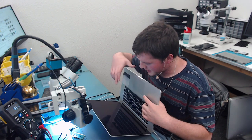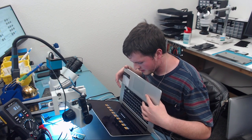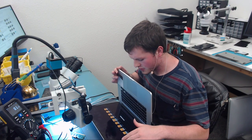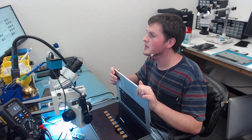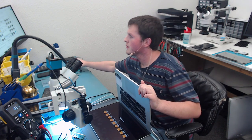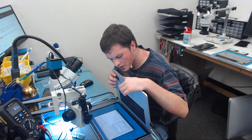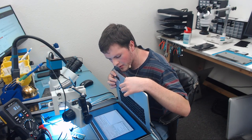Also, sometimes if they don't go in right away. There it goes. So let's go over here to 3S155, which should be the right one for this machine. It'll take a minute to go in there, so in the meantime, we're going to wait. Okay, fully booted into Apple Service Diagnostic. See, we have image on the screen. Everything works. We're going to deselect all these tests, and I'm just going to run video controller external.